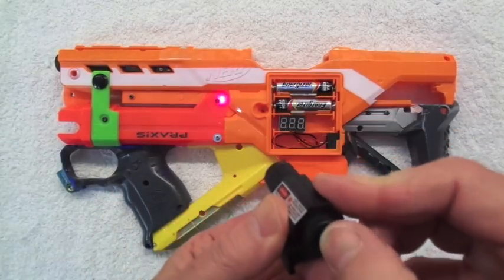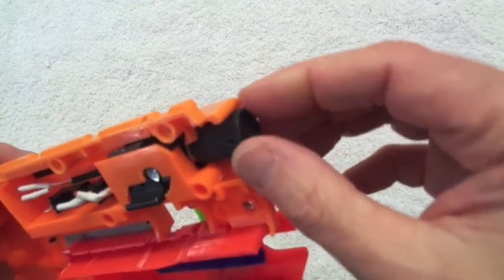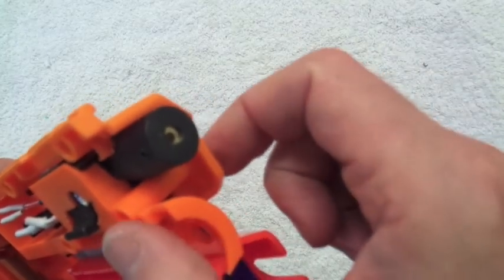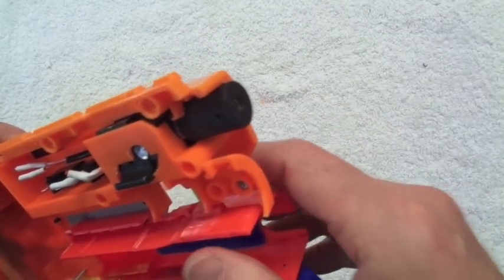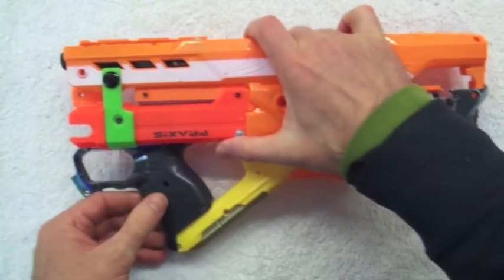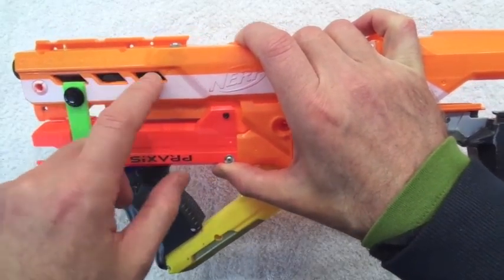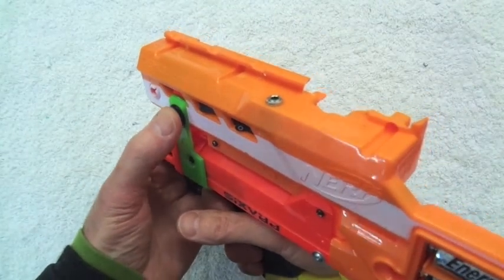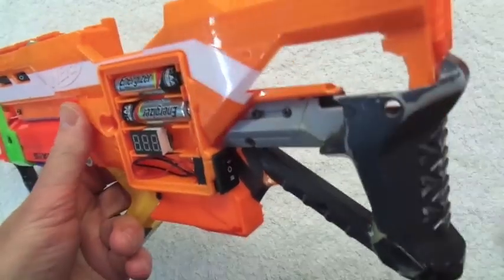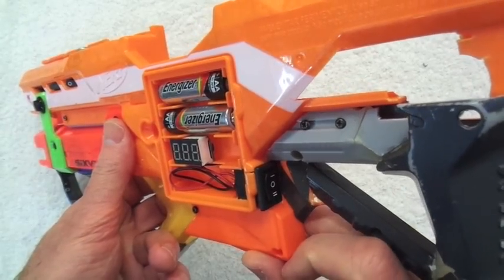On the other shell half you've got the targeting laser — a very small item, integrated into the front between the two shell segments. You can see the size fits quite nicely on top of the screw boss here; it's really only big enough in there for something like that laser. The torch is much better on the right hand side. At the front you've got switches for the laser and torch full on, and a thumb switch toggled back here between the torch and the laser, and completely off for the 3 volt electrical system.